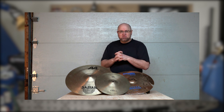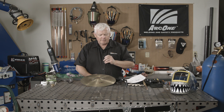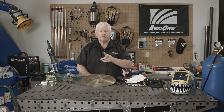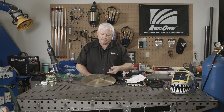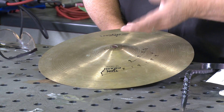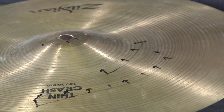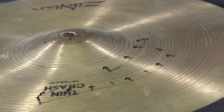I've prepared some samples for Mr. TIG to try. We're going to try different fillers, different methods of welding. The welding portion is kind of a problem because you're overheating these and it changes the pitch of the cymbal. This one is a 14-inch cymbal. We did a visual on it and found several cracks. Because there are so many linear inches of cracking, we're going to use a technique that uses a low temperature solder.